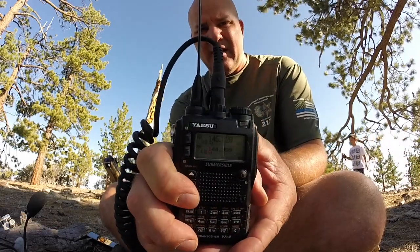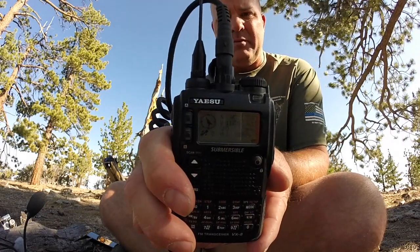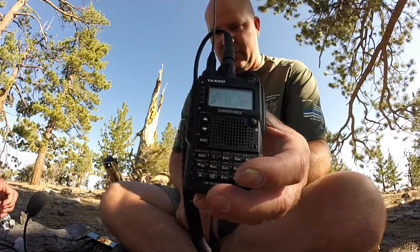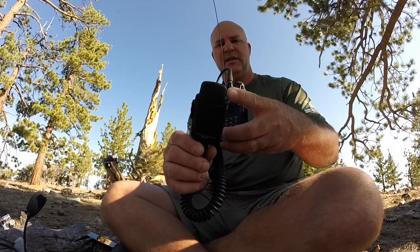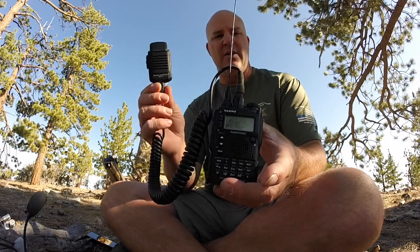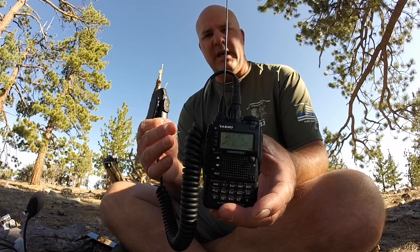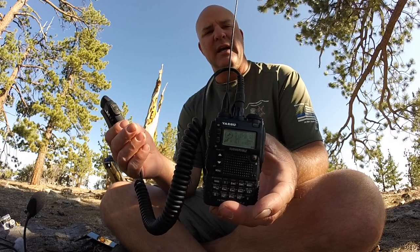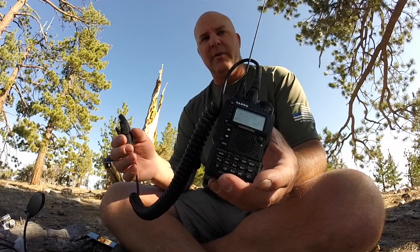When you're in the B-band it shows that frequency. If you just tap the menu — make sure I'm hitting it — you see the first thing that comes up is the coordinates and a little arrow. That little arrow tells you that you have position, and that's because on top of this mic here is a GPS antenna. Without this GPS antenna you're not connecting to the satellites and you're not able to put out an accurate location. Right now I'm beaconing once every three minutes, just a setting I put in there. It's telling everybody that I'm on this beacon but it's not telling any of the summit activators that I'm on this peak and ready to activate — to do that I'm going to send it to the SOTA website, and that's where APRS to SOTA comes in.